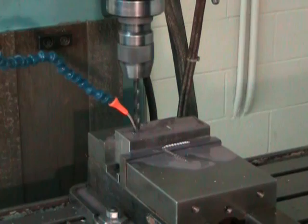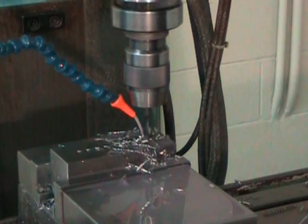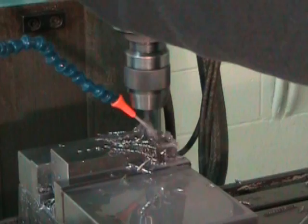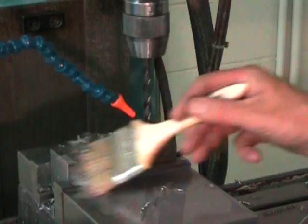So I'm going to cut evenly spaced holes starting at 0, then 10.5mm, then 21mm, then 31.5mm, and finally my end coordinate at 42. And I'm going to do this on both sides of the center of my pocket, which is 0. And that way I don't have to remember all the coordinates. All I have to remember is that from 0, they're all spaced at 10.5mm increments.